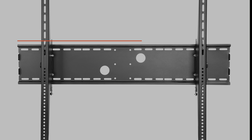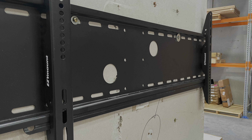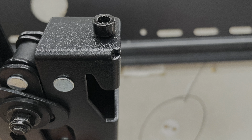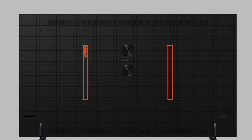Some people want a 1.14-meter wall plate but only need it flat against the wall. Of the vertical arms on fixed mounts, the only one that seemed to work was a VPF80, but we still have three problems. The security bar should be wider, I'd like the vertical to be 600mm to account for all TVs, and it should be lower profile. With the VESA being potentially so wide, you'd also want a micro-adjustment. The problem is that with big TVs, getting access to the micro-adjustment allen key is difficult, so you'd probably like that screw to be really long so you can reach over the top of the TV.